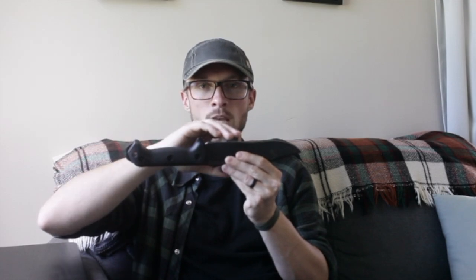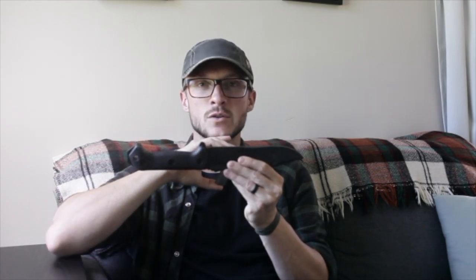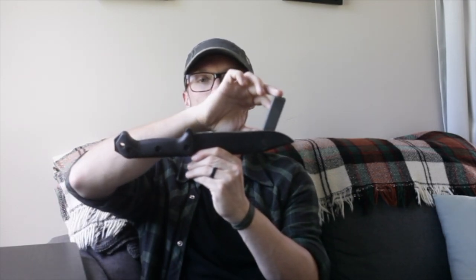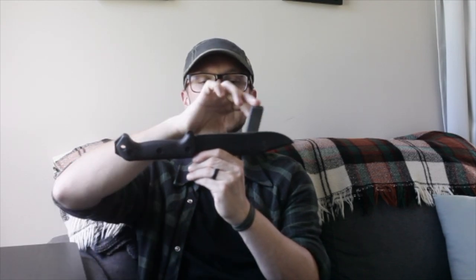And ordinarily, as you're profiling the edge, you would probably wear away at one little section of the edge at a time. But I would recommend, as you get to your strokes where the other side is getting finer, and you need to take the burr off of this side, but you don't want to raise a big burr on this side, make sure that you incorporate some lateral movement across the edge, okay? As much as you can.